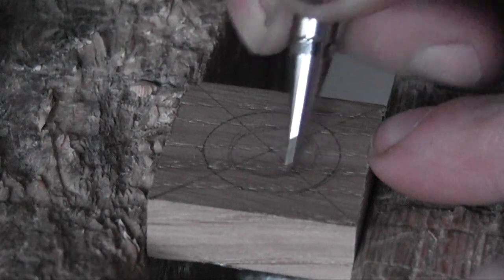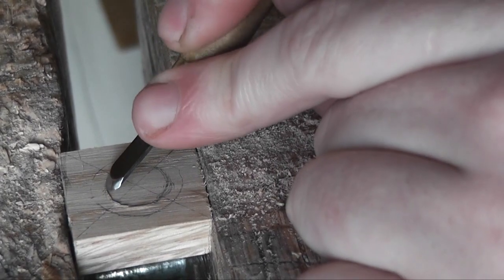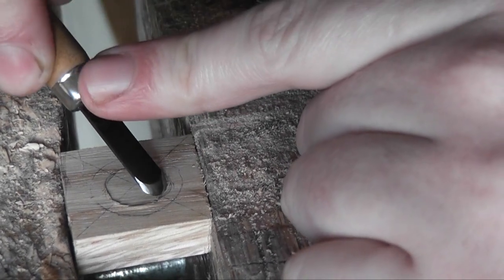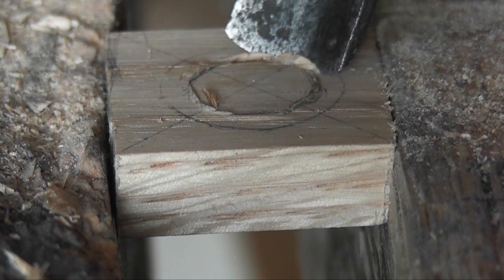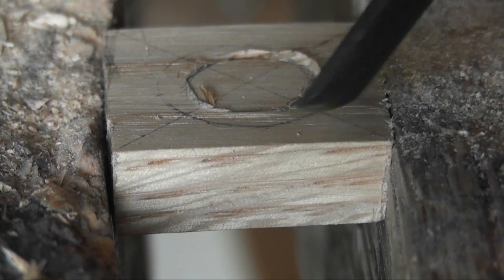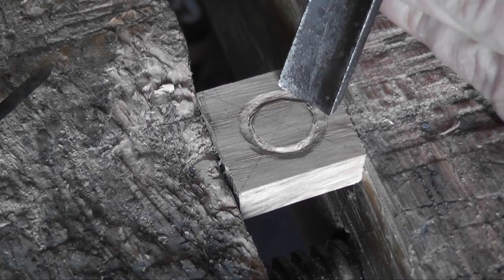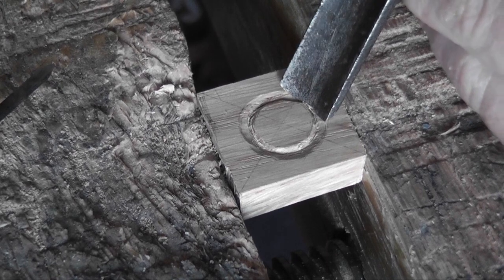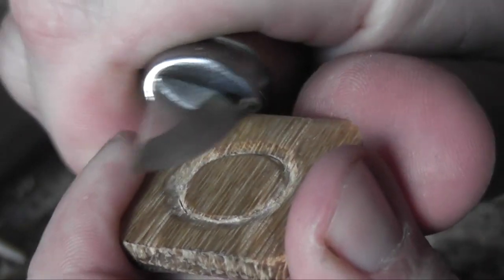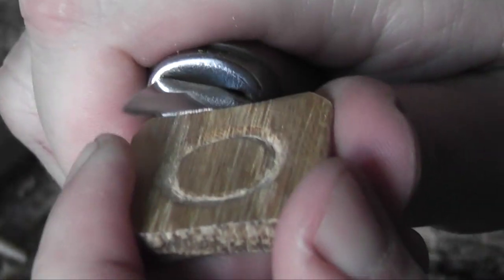I always use something as a template when I can — just use something there as a circle to make a circle, it makes life a lot easier. I cut circles the way I usually do: take the inside out, take the outside out, and do a V-cut so they meet down in the middle. You can see the V shape — sort of a valley. Then I used my Mora knife to smooth off and chamfer around the edges, which just makes the counters nicer to hold.